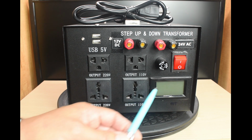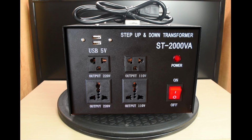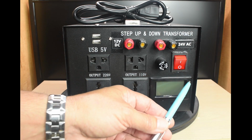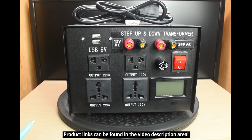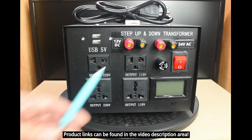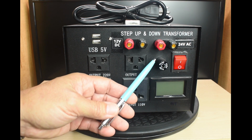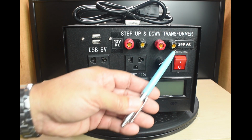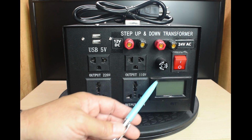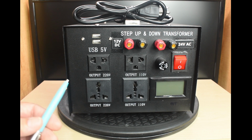At the lower right, you can see that the switch, where it was in the previous image of the unmodified version, has been moved up to this point, and I added this LCD display. The display tells me the input voltage as well as the input current. This fuse holder has a bus fuse inside of it rated 3 amps, and that's connected to the 120 volt input that supplies power to the 12 volt section, the 24 volt section, and the LCD display. This whole thing ended up costing me just under $100 with all the modifications.